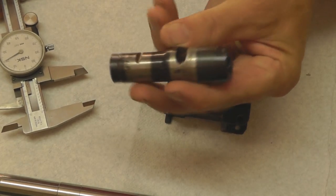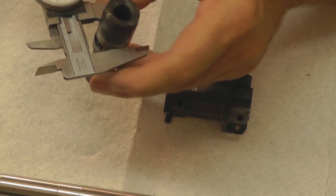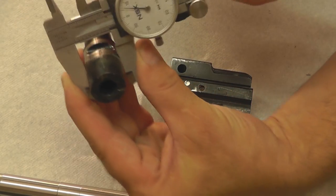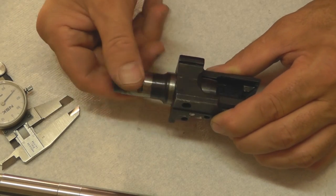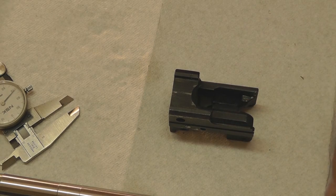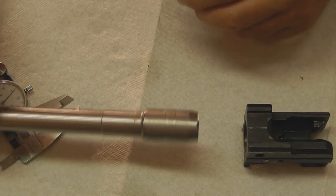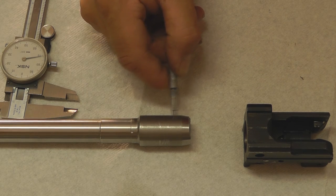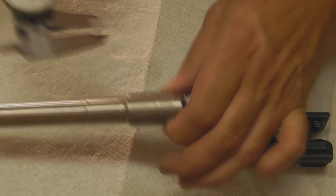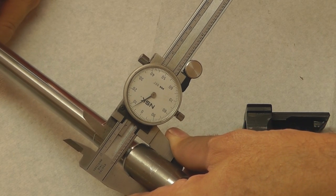This is a barrel stub from another Yugo kit — the one I did the build video on — and it's about 906 and a half. So there's a huge difference. This barrel is a drop fit into the front trunnion. The new replacement barrel we have here, which would be perfect, is also a drop-in fit. We can't have that. The diameter of the barrel is reduced from here to here — less than 906 — and then from here up it's 906, reading 907. That'll be a nice tight press-in fit for a 906 diameter front trunnion, but of course it's too loose for this one.